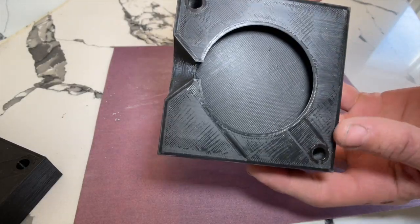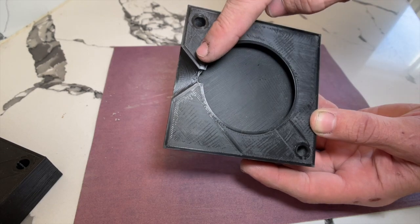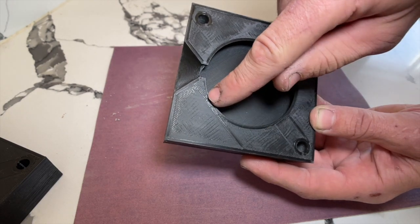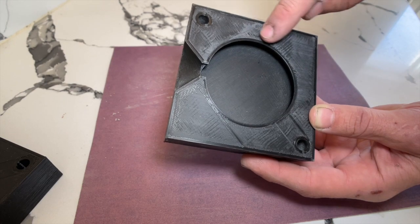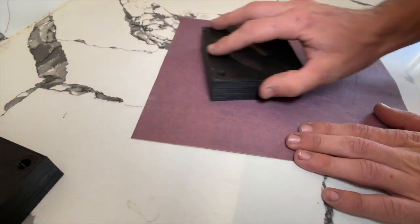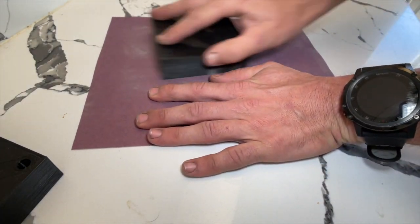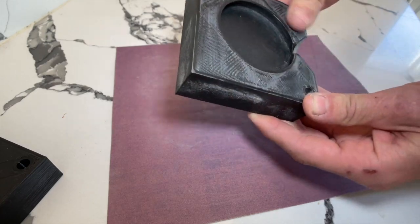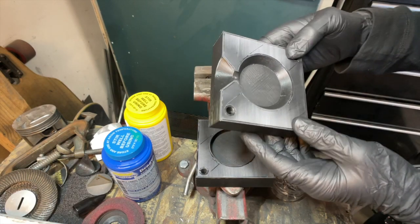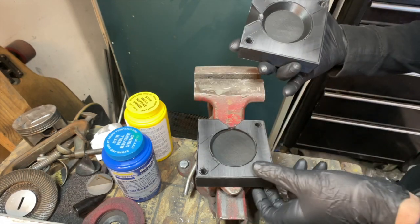What I'm looking for here is a change in the circle versus everything that's been sanded. I want to sand just to this circle right here — otherwise it'll leak out to the sanded area, so I need it sealed all the way to this edge. I started with 320 grit and finished with 600 — not wet, just dry both times. Here's our finished sanded product.